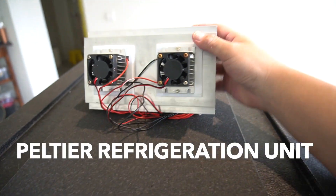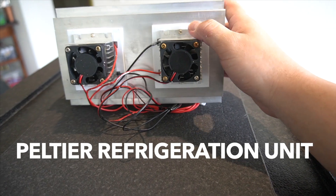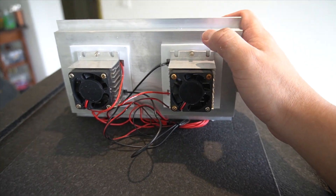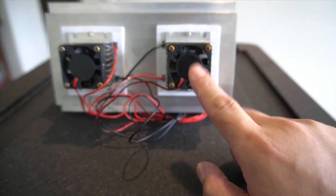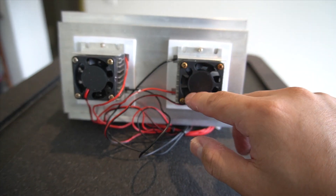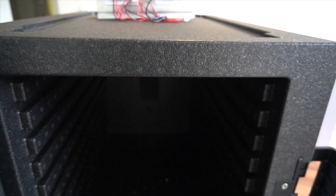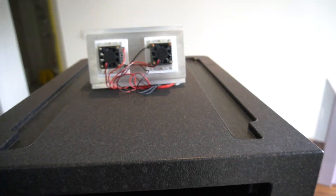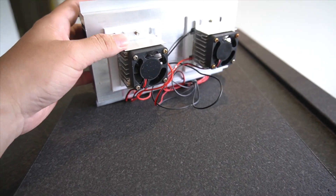For the cooling, I'm using what's called a Peltier chip — it's a semiconductor chip where one side vents out heat and the other side cools down. The main issue is that because Koji incubates in a very humid environment, any cooling surface will create tons of condensation. I'm going to find some kind of food pan to collect all the condensation. That seems like an easy solution for now, though it is the main challenge.